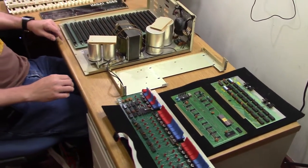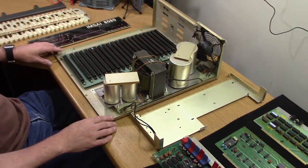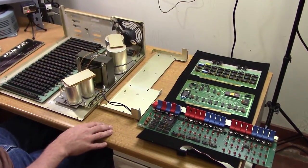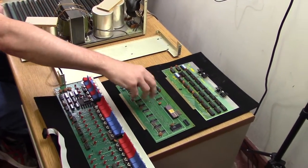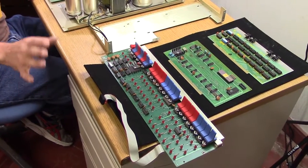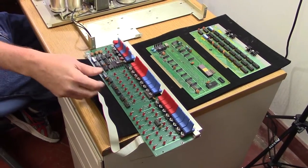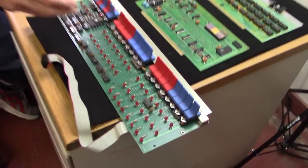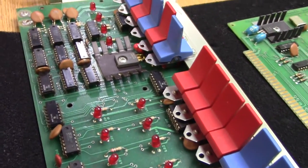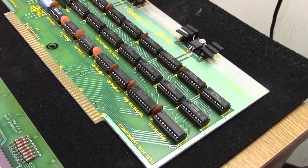So where do you begin with something like this? Is this what it looked like when you first got it? Oh, heavens no. This is what it looked like after about the first two-thirds or three-quarters of the work was done. The machine as it initially came essentially came with a processor board, a RAM board, and the front panel board — essentially all as bare boards with no components on them at all, no chips, no sockets, no anything — and reams and reams of parts. All of these switches in a bag, all of these chips on static foam, all of these LEDs and other components in bags. You spent a considerable amount of your initial time on the workbench soldering these things together.